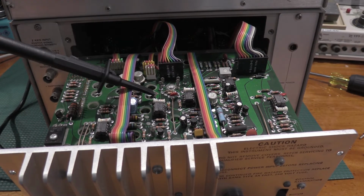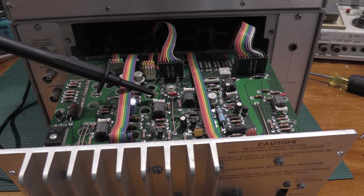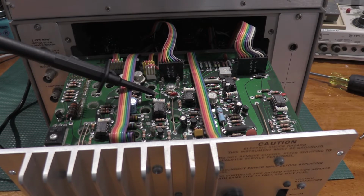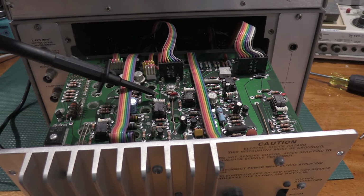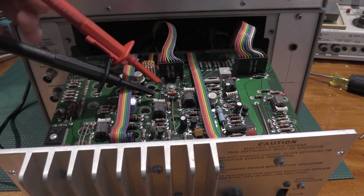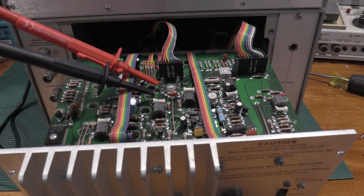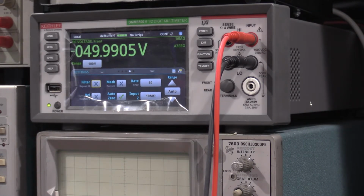Okay, in my case, this is the 04 variant of this power board, so there is no 54.2 volt test point. So I start directly with the negative 50 volt adjustment, because that's the base supply for the whole board. So that's my adjustment for the negative 50 volts. So I'll get the meter hooked up and then we will check it. My tolerance on the negative 50 volts is plus minus 0.2, negative 49.99. So that one's good there, no adjustment needed.